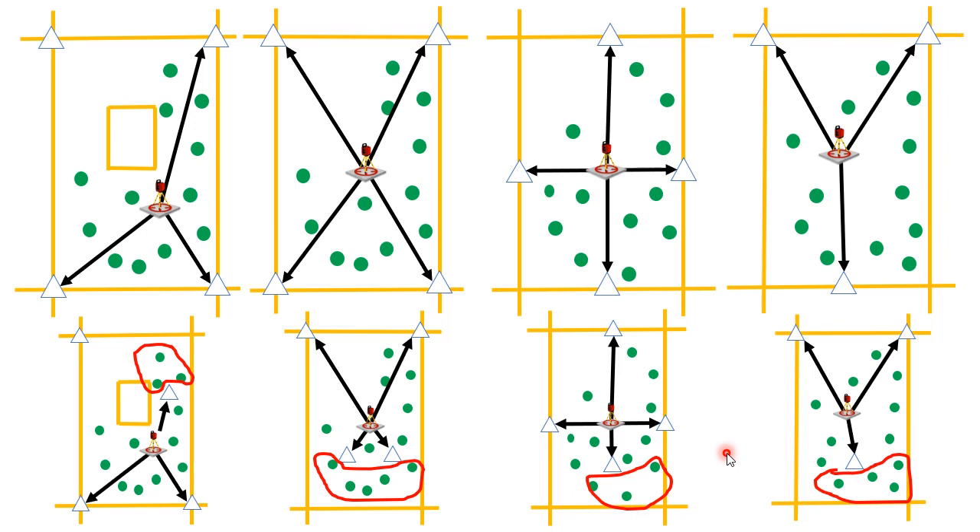If I were to complete this diagram, in these situations I'd want to have some control points on the exterior part of those layout points. And maybe if I had to, I'd move the total station down to that area, restation, and finish the layout. Just something to be aware of.